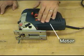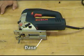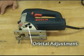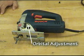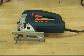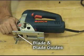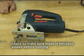You have your motor area and some sort of base — some people call it a shoe. You have an orbital adjustment. What this does is instead of just going straight up and down, which is reciprocating, you're going to have a forward and backward motion, making a more aggressive cut. Here on the front of the saw, there are two wheels or guides to keep the blade going straight up and down. You need to make sure the blade is always between those when you're cutting.